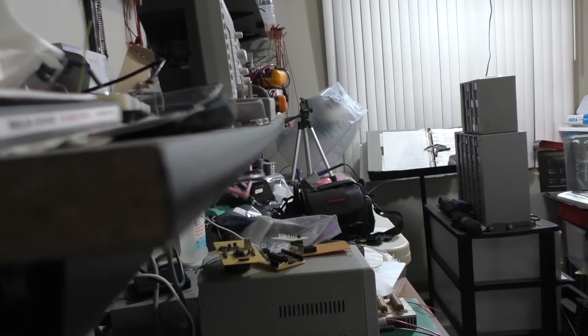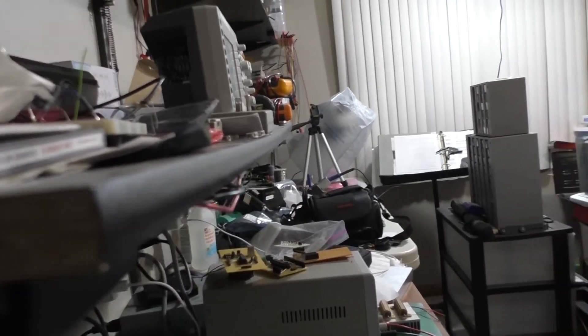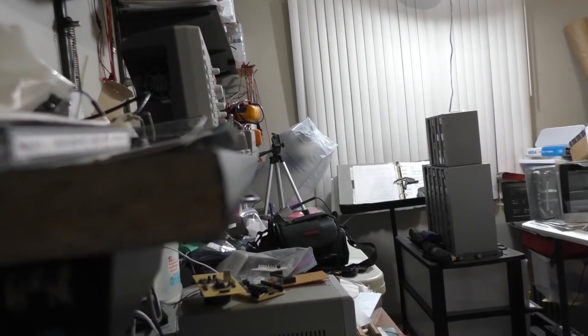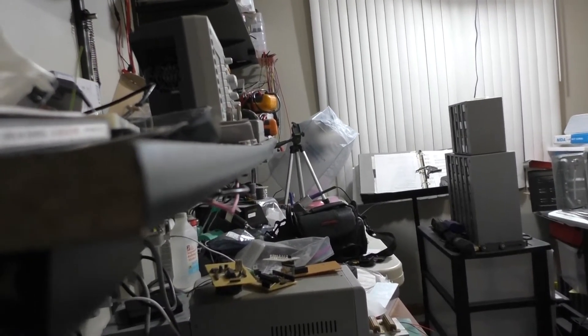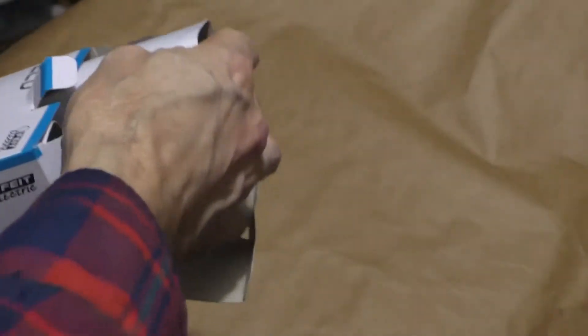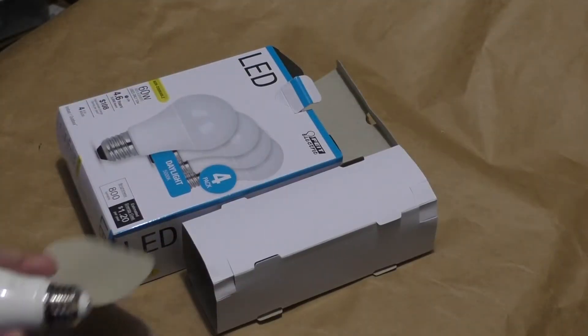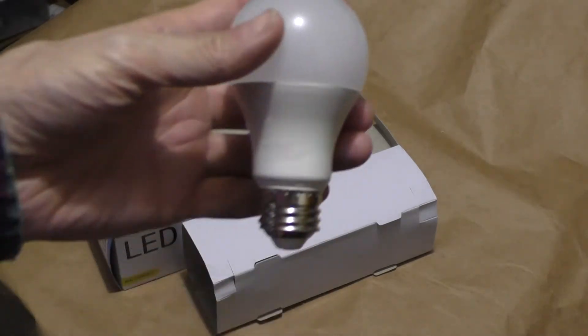As you can see from the condition of this shelf — it's all bent up like a banana — I'm gonna need a new shelf. This time I'm gonna put some rails in the bottom to keep it straight, and also fix up these rather miserable looking lights underneath the shelf. They're soft white, really yellow and dingy. I like the bright white daylight LEDs. I picked up some daylight white LEDs and I'm gonna pull these apart, take the circuit board out, and attach it to an aluminum heatsink on the rails underneath the shelf. Hopefully this will give me some brighter LEDs.